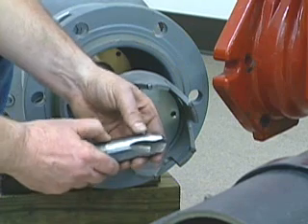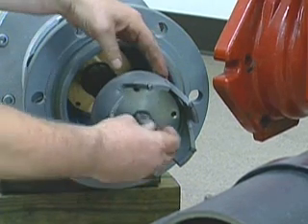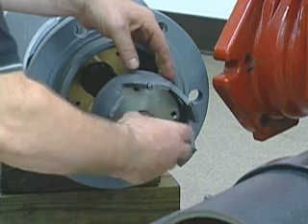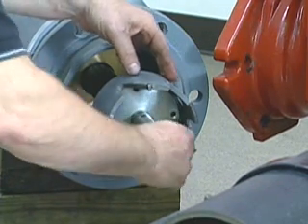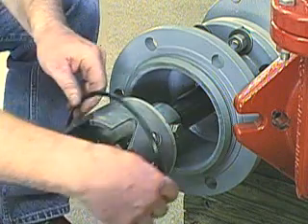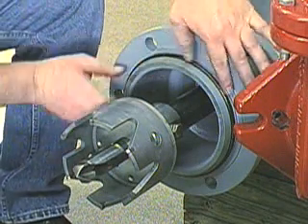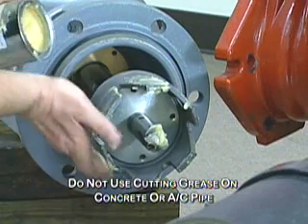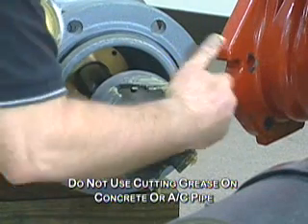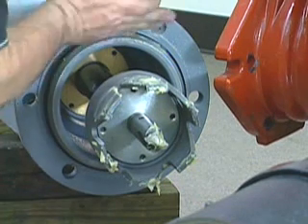Make sure the detents on the pilot drill are compressible and will spring back to their original position. Now, thread the pilot drill into the hub. Place the O-ring on the front of the adapter, fitting it into the groove. Apply cutting grease to the tips of the cutting edges of the shell cutter and the pilot drill, and also on the O-ring in front of the adapter.